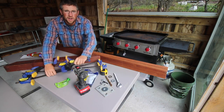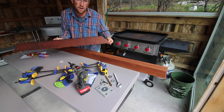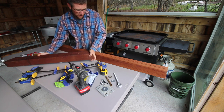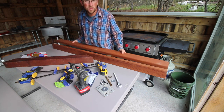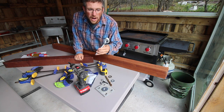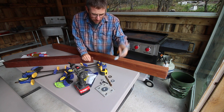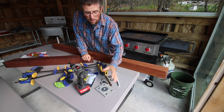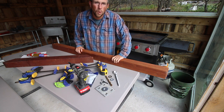What we're going to be using to build our arm: we have a four-foot piece of four-by-four mahogany and then we have two five-and-a-half-foot-long pieces of two-by-four mahogany that we're going to put together. We have one eye bolt — it's a forged eye bolt rated for 2,200 pounds. We've got some washers, some nuts, and a metal plate. We need to get this assembled and then we're going to install it in our meat pole.